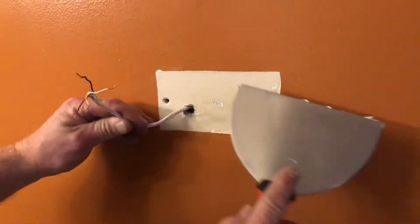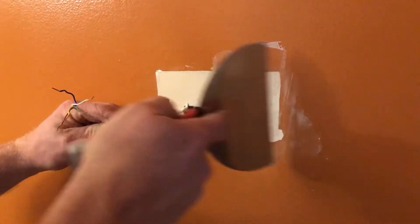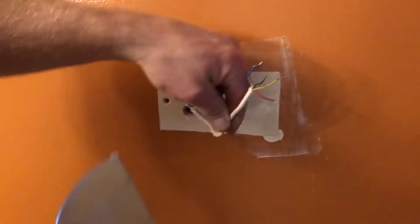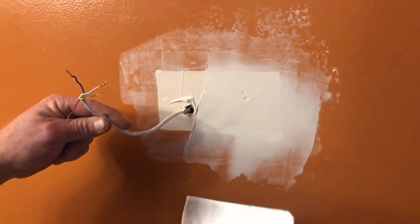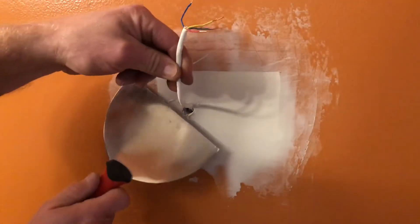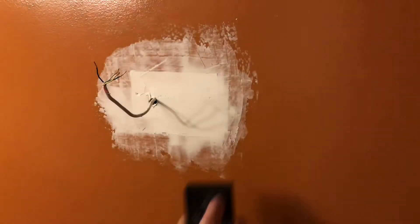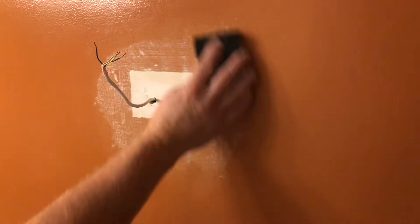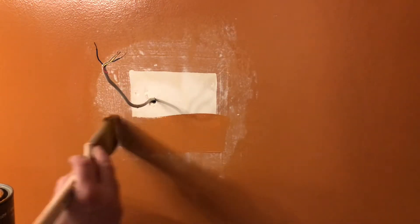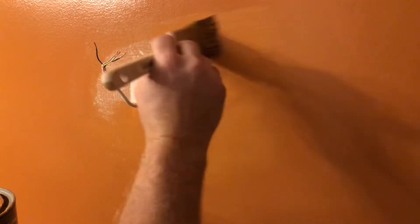Next I'm going to do a little repair. Since I've got this off, I've got some spackling — I'll patch the wall, fill in the old holes, and get it nice and neat looking, so when I put my new thermostat up it'll be a professional looking job. Now that my spackling's all dried, I'll go ahead and sand it smooth, knock down the edges, and then come back and paint the area, feather in the edges of the paint, and try to make it look as natural as possible.